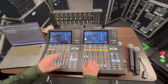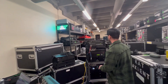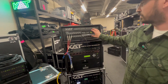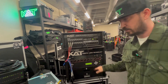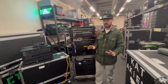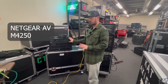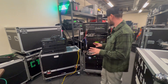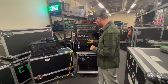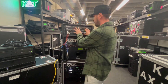The master stereo output on this console is feeding the outputs of the Rio, so you've got to be pretty versed in Dante to accomplish this. The inputs on the console on the left are taken from this Rio and the outputs are fed by the console on the right — in this case it's just feeding a FOSTEX. I kept my network very simple: everything is set up to DHCP, I only used primary lines, and I'm using Netgear — I believe these are 4250s — as my switches. To recreate this: two DM3s, a Dugan D2, a Behringer Ultra Gain digital preamp strip for phantom power to a gooseneck mic, and a Rio acting as my stage box.